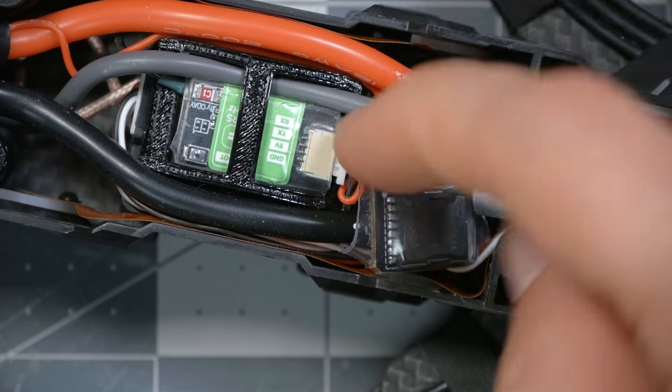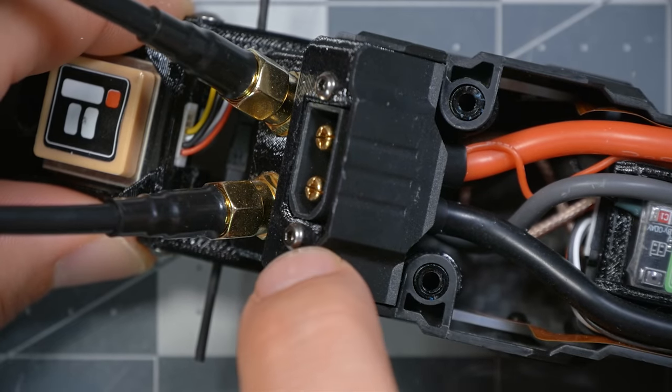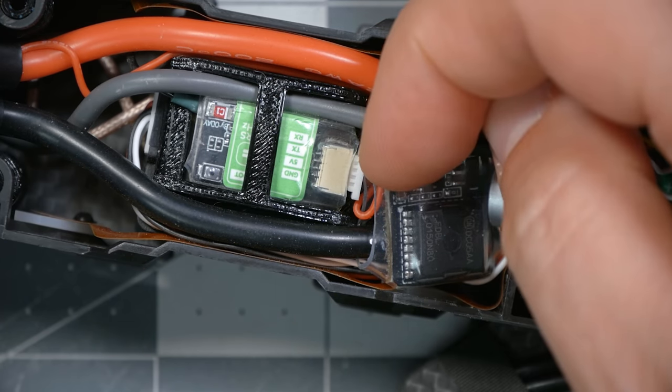This little guy here, what is this? I've never seen one of these on a quadcopter before, but I think I figured out what it is. So when you're running 6S batteries, and especially really big 6S batteries, you can get a great big spark or pop when you first plug the battery in. And it kind of freaks people out. They just don't like it. But also, it can cause scorching on your XT60, or in some cases even damage it. I think this must be the anti-spark device. You can get XT90 connectors with built-in anti-spark capabilities, but I don't think anybody makes an XT60 with anti-spark.